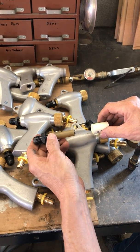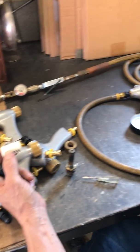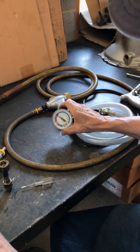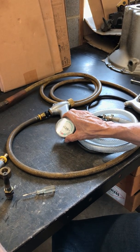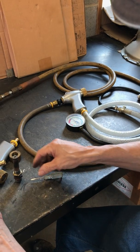Too far away is not right, but we need to get the proper setup. What we do is run air through the bead blast gun and have a vacuum gauge hooked up to it, and we're aiming for 17 to 21 inches of vacuum. If that happens, we know we're going to have a good gun.